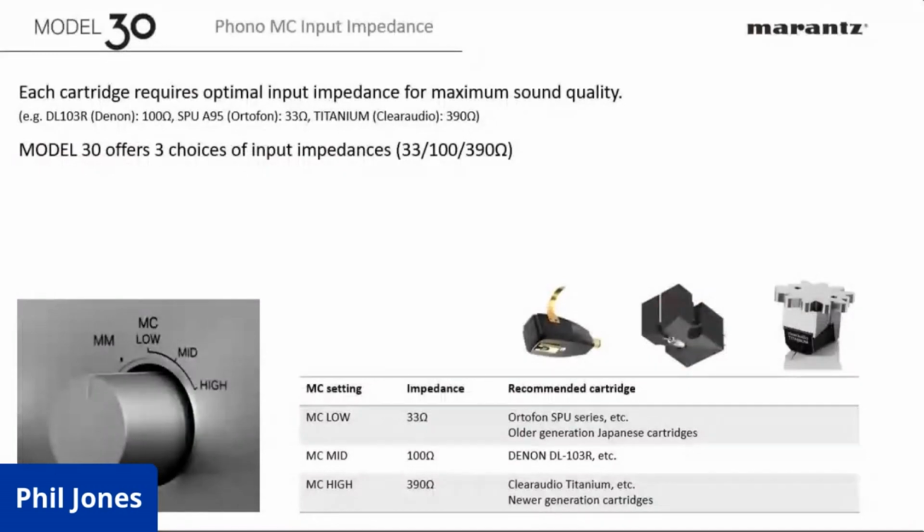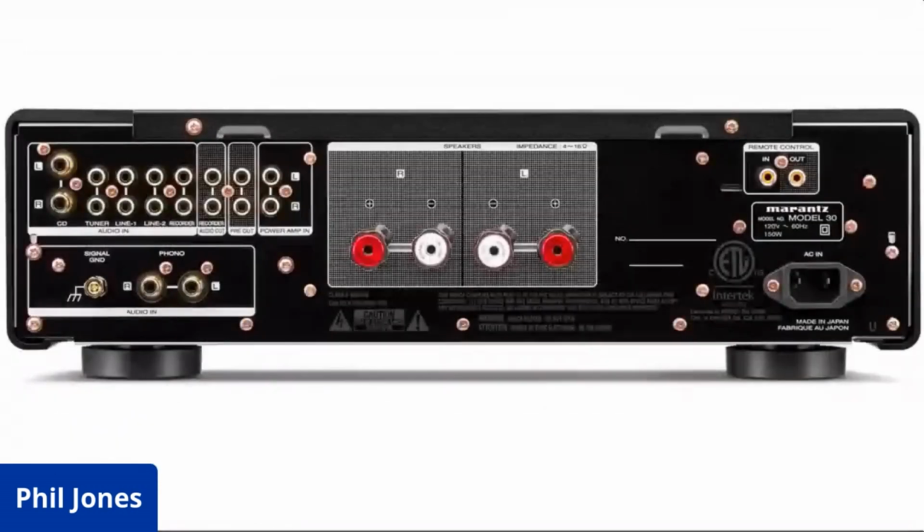Nice. I just want to make one quick comment on the back panel of that product. It says power consumption 150 watts. I'm actually going to do a separate video on this. That's not a max power rating. I know people keep asking that on YouTube, and I'm going to do a whole video on this, because I went back and forth with Dan and the engineers, and now I know how this is rated. It's rated at a much lower power, and then the amplifier efficiencies actually consume more power as a result, and they come up with this number. But we'll talk about that separately. I don't want anyone to say, hey, this is a 200 watt amplifier and it says 150 on the back panel.